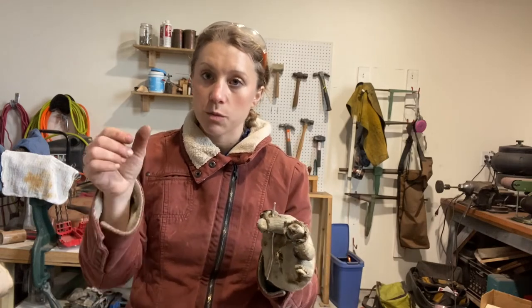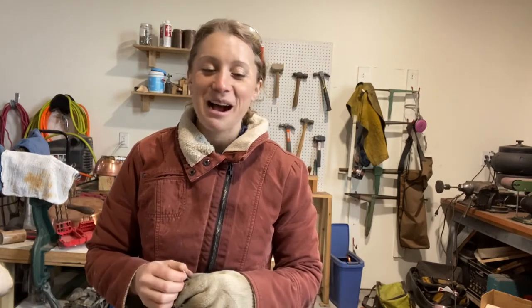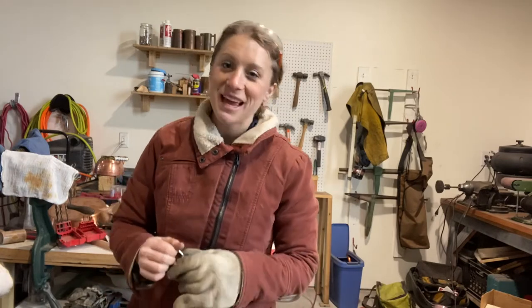If you are making spouts — how I was taught by Bob and how he makes spouts — a lot of times you will burr out part of the spout. You make a seam allowance for about an eighth of an inch to burr out to sit flush against the body of your piece. Then you actually drill and rivet that spout on so that even if it boils dry it won't fall off. That's not helpful with this piece, which I think was made in India or someplace where they don't do that, which is fine.